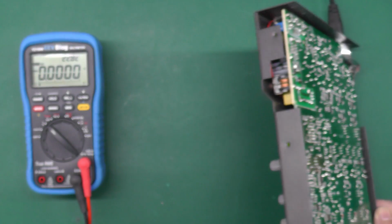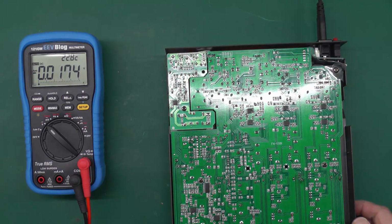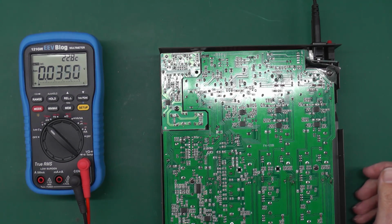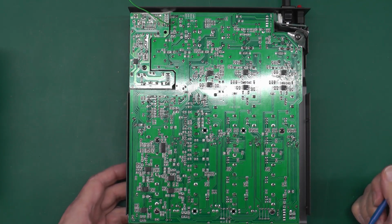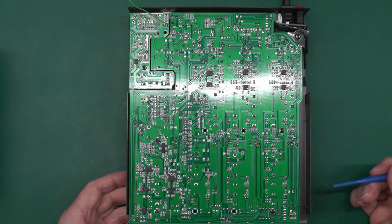We're already going like the clappers on the LEDs, so there's obviously a problem already. So I think actually I'm going to scope the plus and minus 15 and the 48 volts, and we'll just see how noisy they are. Well, I just scoped the supplies off camera, and they're stable enough. Even the 48 volts is not too bad.